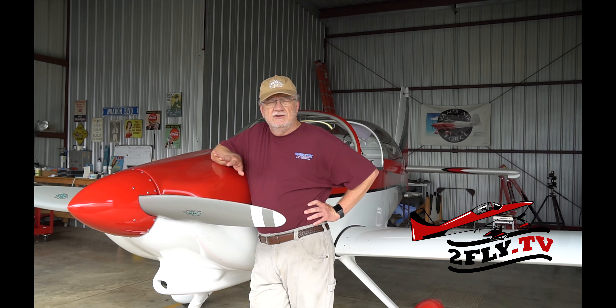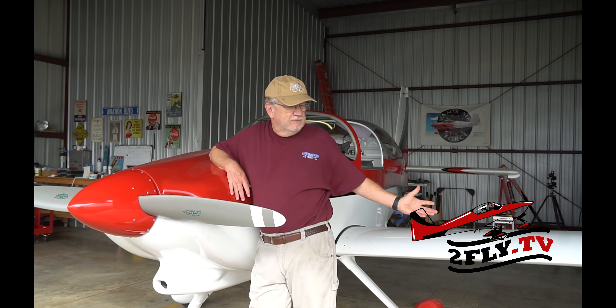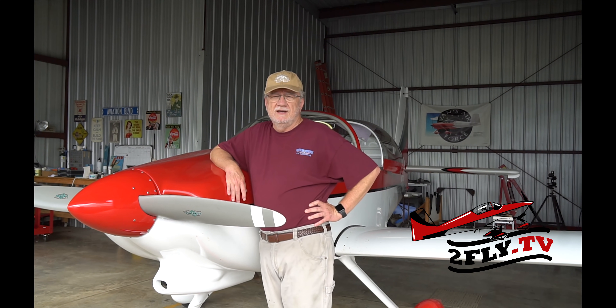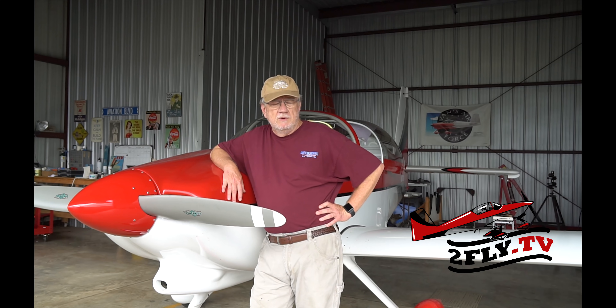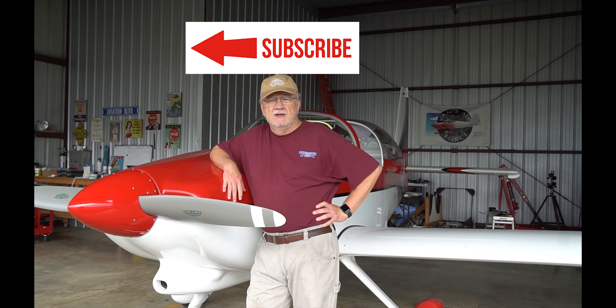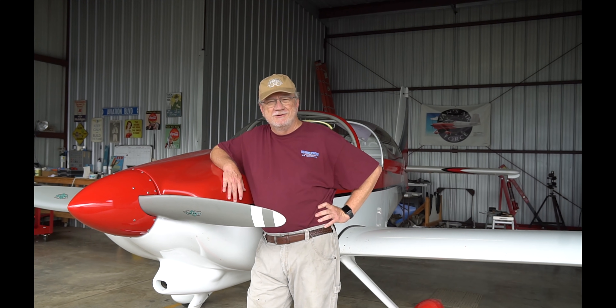And there you have it guys — that's the interior of our cylinders on our Lycoming IO320 in our Vans RV9A. Everything looked good at 1,000 hours. There were a few little areas of discoloration and obviously some lead deposits from a thousand hours of running on 100 low-lead gasoline. We should be basically halfway through the average life of a Lycoming. We appreciate you watching — we'd love for you to give us a thumbs up and make comments in the comment section, especially if you're an aircraft mechanic and saw something of interest or concern. Also hit that subscribe button. We need a few more subscribers. Thank you.